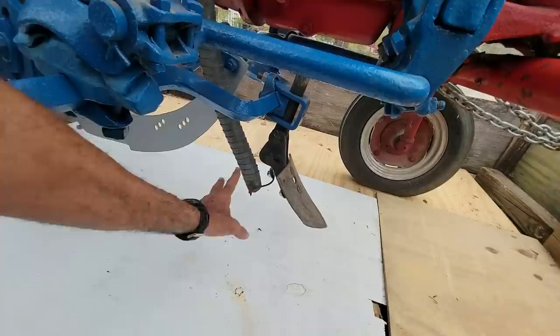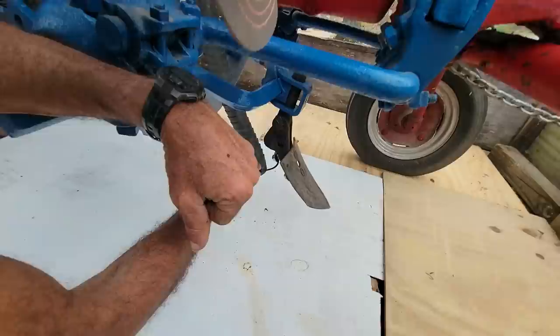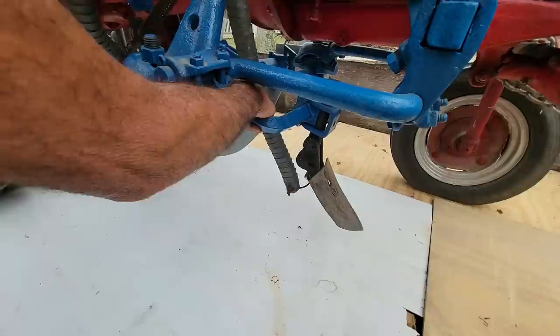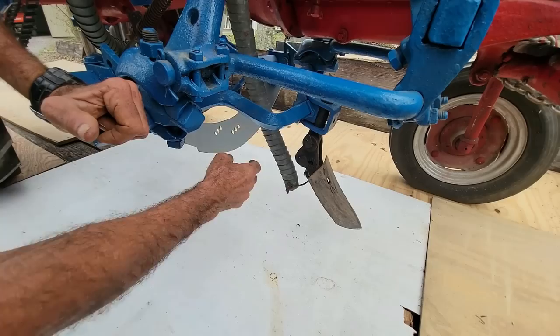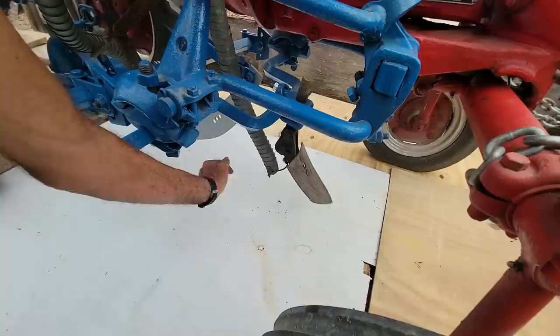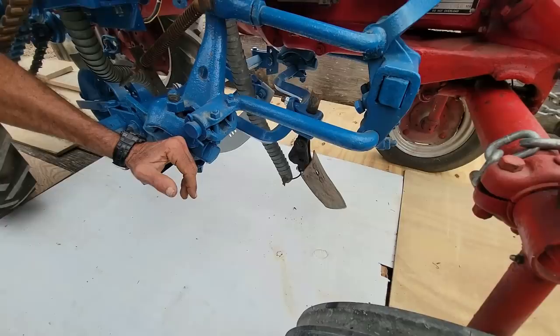There's about three or four different ways they showed doing this. You could take your seed tube and put an extra long bolt back here and mount it back here to your little rod that goes on your seed tube so that it dumps out fertilizer right here behind this, down in that deep furrow. Or I could have took another one of these clevises and mounted it right on the side right here. And I have another plow system that goes down here that this tube fits down in, but the tube was too long to fit right here up close. So being as I couldn't put it up here too close, I would have rather put the fertilizer over to the side deep in the ground, but I couldn't because the seed tube, they call it a seed tube, was just too long. So I got that hooked up, and I've got it all in there centered up and everything.